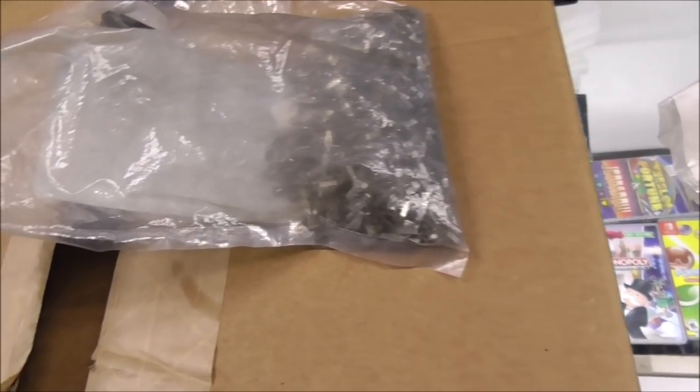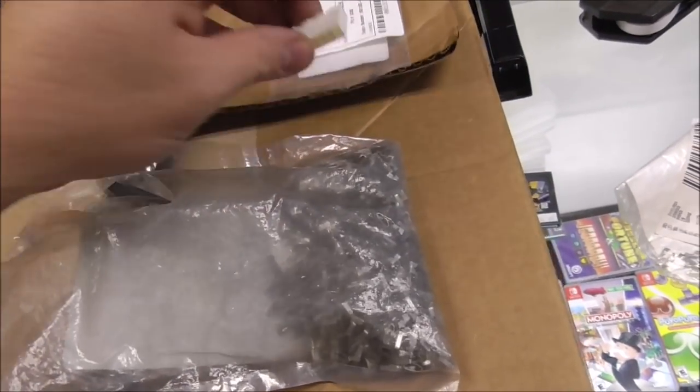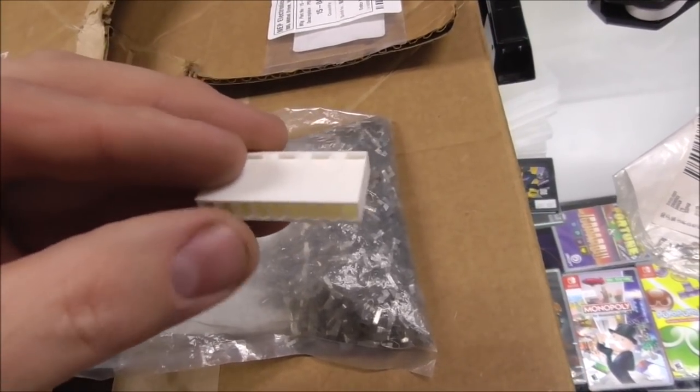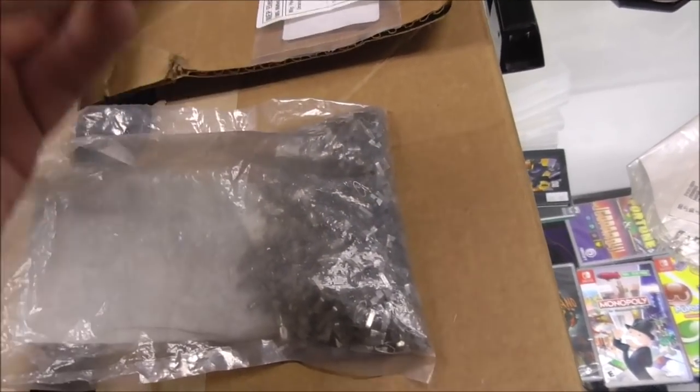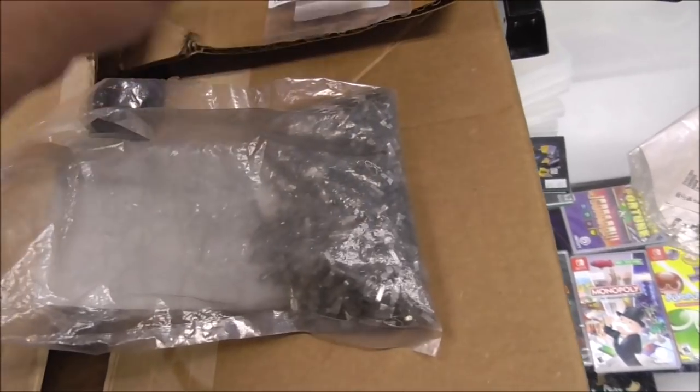Okay, so I'm just going to carefully cut each wire, and then one by one, slide them into the back, crimp them on, and replace that connector with a brand new one, brand new connections on the wire. And let me show you the crimpers that I use.